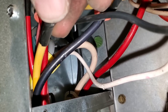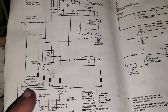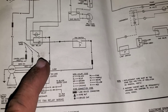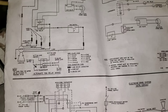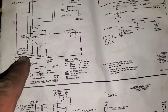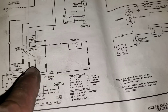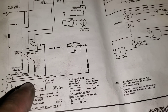At this point we know this speed isn't even being used, so we could disconnect this wire and cap it off. Our next one is going to be our orange wire — 'O' is orange. When it connects into the line splice connector, the harness, it goes to the pink, and that pink is also taped off — that controls the medium-low speed. Now, these wires coming off of our motor basically control the speeds of the blower motor. But also note: the leads from the motor may be changed to the required speed, so keep in mind that even though it shows the orange tying into the pink and being taped off, it may actually be tied into a different terminal because we're controlling different speeds for cooling and for heat.